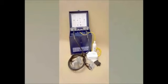The 690E is the most powerful, and like all FreezeMaster machines, can freeze two pipes, from domestic through light industrial to heavy commercial. It can freeze 8, 10, 15, 22, 28, 35, 42, 49, 54 and 61mm, which is the outside diameter of 2-inch iron.